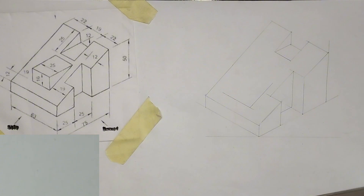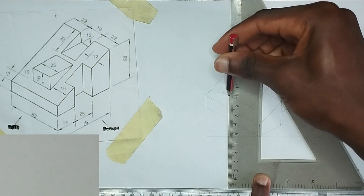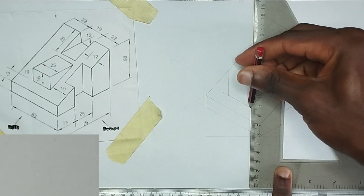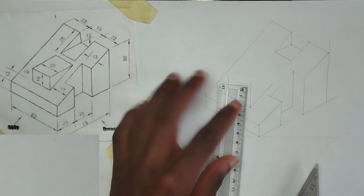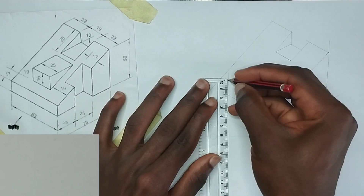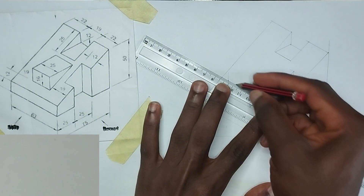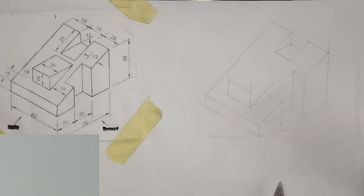We have been given the distance to be 25 millimeter, so I'm going to pick 25 millimeter here. Then at that point I'm going to draw a straight line upward like this, then at this point also I'll draw a straight vertical line upward. The height is 16, so I'm going to pick 16, then pick 16 here, and join these two points together.